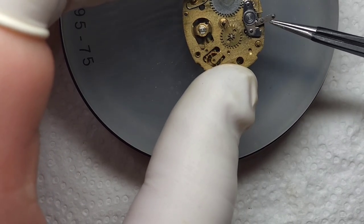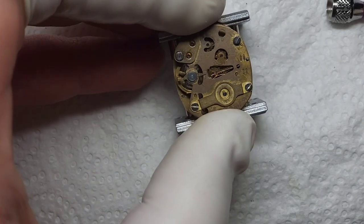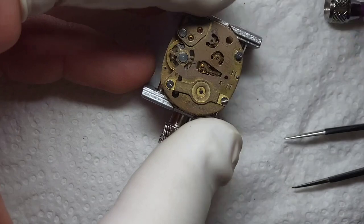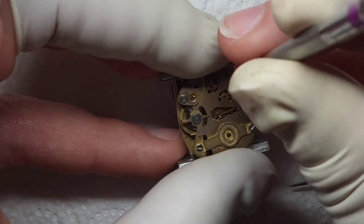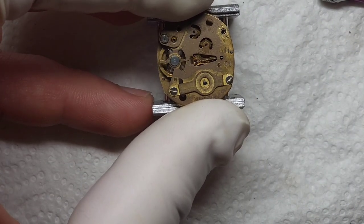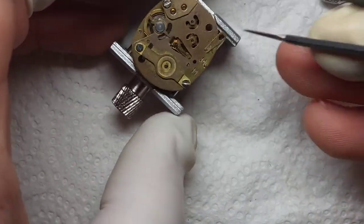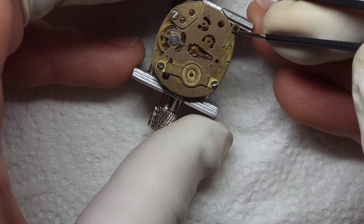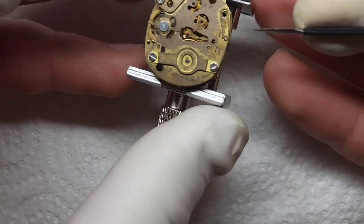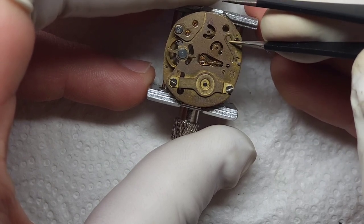There's no strict keyless works on this, though there is something I'm playing with now. There's nothing like you'd realize in a modern watch, but there is this nice little retainer I was playing with before. To put that on I've got to remove a screw to put that carrier back in with the little circlip slot, just to make sure it all engages and retains that stem. You can see it all keys together - there's a nice little slot so you can just slacken off that screw.